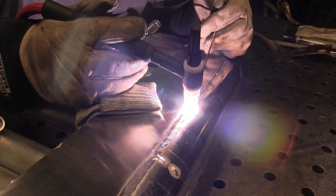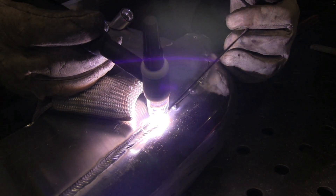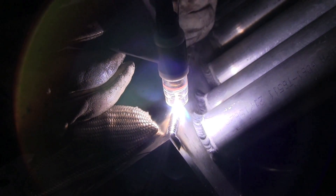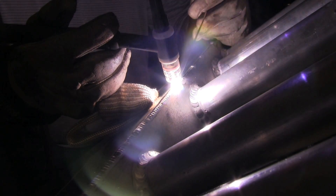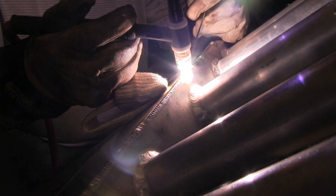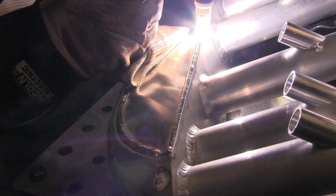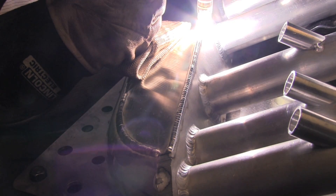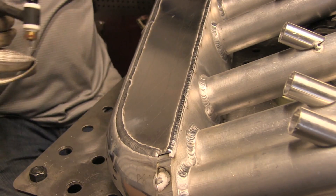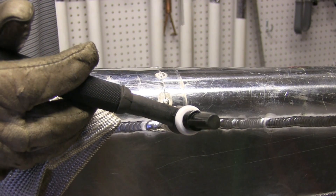The arc you're listening to right now is the Everlast 255 EXT — about 100 hertz, 31% cleaning action. This is a whole different torch setup; notice it doesn't have the valve on it, but I'm using that same number eight Pyrex cup, mainly because it kind of illuminates the whole area and makes for better filming. I could almost make this whole run without stopping if I wasn't filming and wanted different angles — which is kind of what you want to do a lot of times. Not always. Sometimes you want to stop, reposition, change the heat, or sequence the bead differently. Being able to drag a TIG finger along a nice smooth aluminum surface really helps a whole bunch.